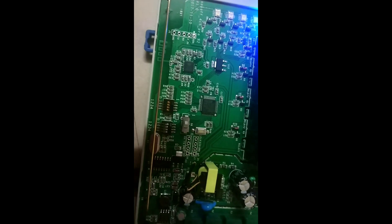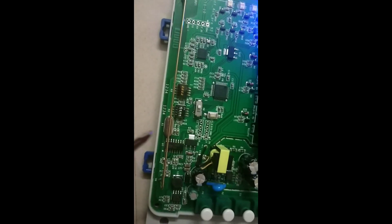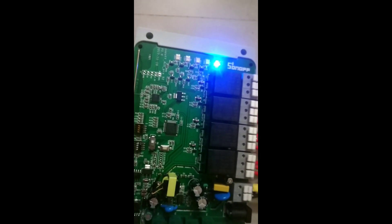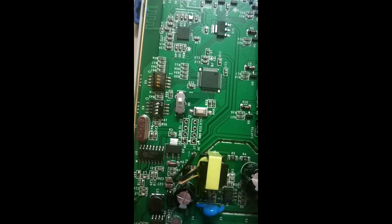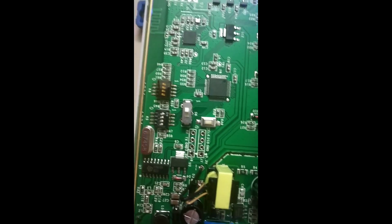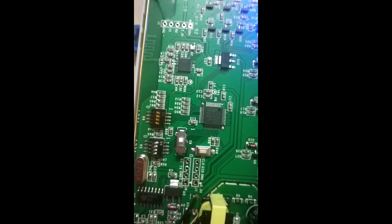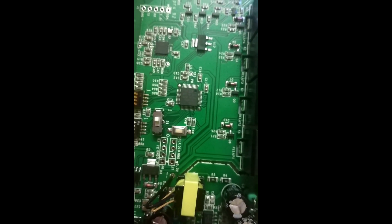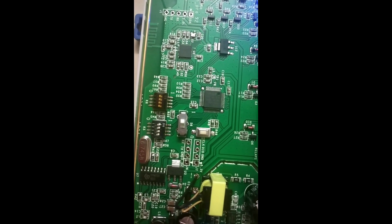This is the top — I have made all the switches on the upper side. You need to remove the top switches cover — there is a white plastic sheet you need to remove. You need to shift it to the upper side, and also move the top of the switch to the left side. Only then will it go to individual control; otherwise by default it will be in self-locking and inching mode.